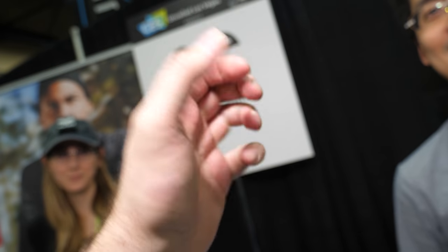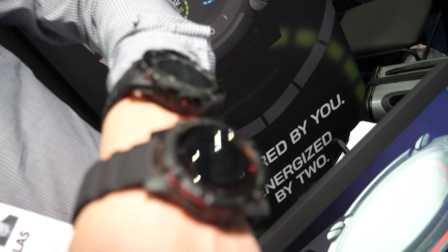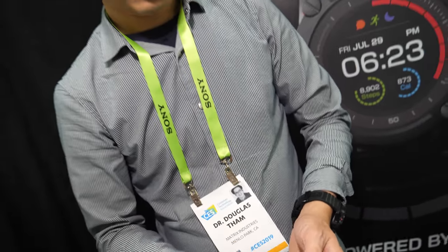This is also called kinetic, yeah — but that's only for watch dials. You're doing the full smartwatch. Yes, which is very special. Is nobody doing this? The key is to really control power consumption with all the algorithms and firmware and try to lower it to the point where energy harvesting can actually step in. Do you have some kind of supercapacitor? It's a LiPo battery. And it will last for how long? You should never charge it. If you wear it outside, inside, all the time, you will never have to charge it.